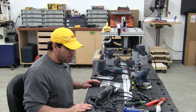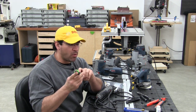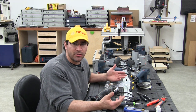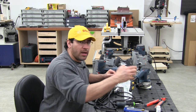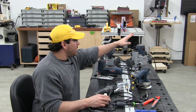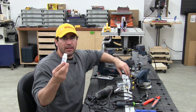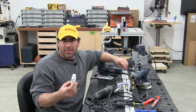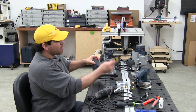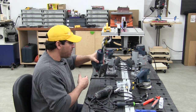The tools you're going to need: a T8 Torx bit to connect the wire to the fitting, a way to cut and strip the wires — I have a utility knife, wire cutters, and wire strippers. I also found that on the first two installations — on my sander and a router — you really need some kind of lubrication, whether hand soap or o-ring lubricant. You put it on the wire, and it helps slide the rubber grommet onto the cable.